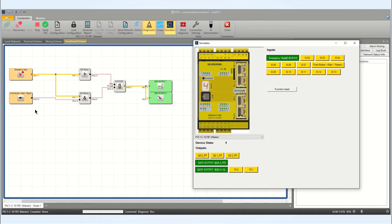Now, if the reset button is manipulated — shown here by our yellow line — if our e-stop is pressed, my safety outputs shut down, keeping us safe. However, when I reengage the safety emergency stop, you'll see that our safety outputs energize without the use of the reset button.